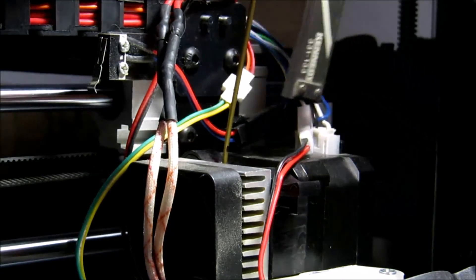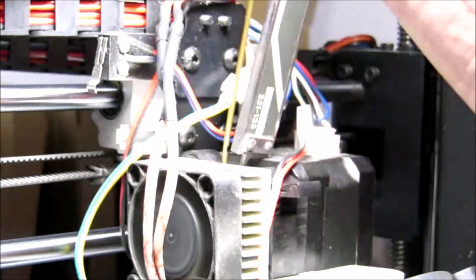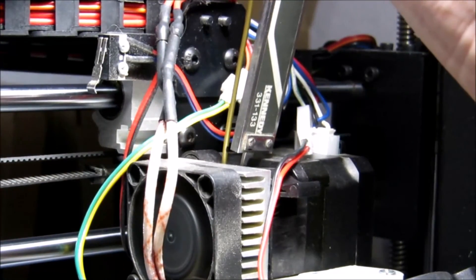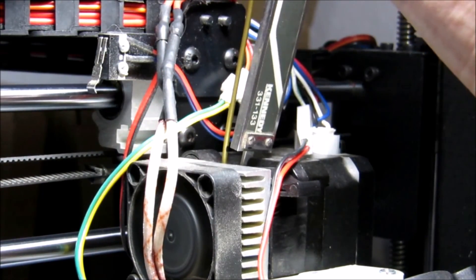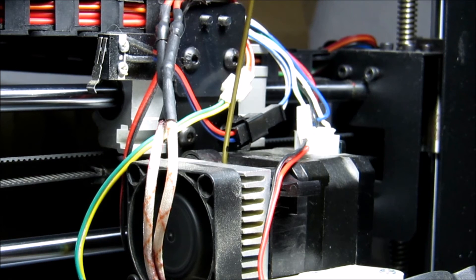Let me just get in there and see what that distance is. And again, yes — 5 millimeters thereabouts. So now we can put in the factor, the multiplier that we can work out to adjust that extrusion rate.